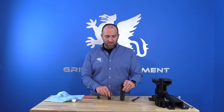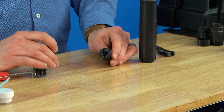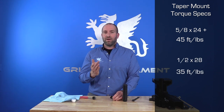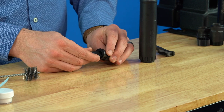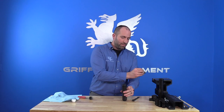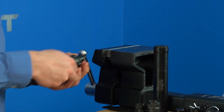If you ever get a Griffin muzzle device stuck in the silencer, we do have a provision for that — a slotted milled provision at the rear of the silencer. Don't worry, only 1% or less of Griffin users will ever have this problem. It's really only evident when you don't install the muzzle device to its appropriate torque: 35 foot-pounds for a 1/2-inch thread and 45 foot-pounds for a 5/8-inch thread or larger. If you under-torque on install, you might get it stuck, and we have a tool that interfaces with that slot — you fixture it in a vise and very easily get your muzzle device out.